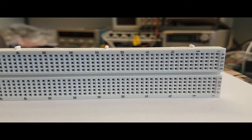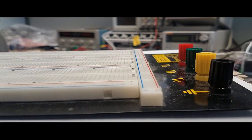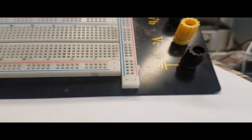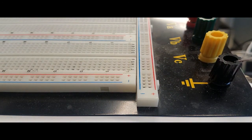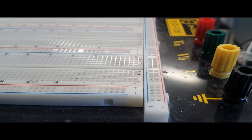Before concluding, I want to show you a different type of breadboard — a bigger one typically used for larger prototyping. What's important about this breadboard is that it has power supply terminals. I call them the bus supply rails or star nodes. It has outlets that take male banana clip connectors for the power supply — for example, one for ground and terminals labeled A, B, C for up to three power supplies.